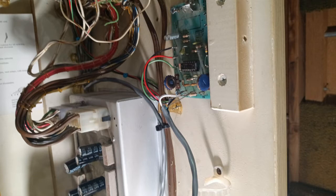How do I determine the size of that resistor? I looked through the schematics for similar situations where we had a signal output coming into a preamp circuit — what was the most common resistor value? I found that 47k, 47,000 ohms, was the most common. I didn't have any 47k but I had some 51k, and that turned out to be kind of perfect, so I just soldered it in. The signal was just right when the two potentiometers are about the same level, giving a good even level between the traps and the piano.